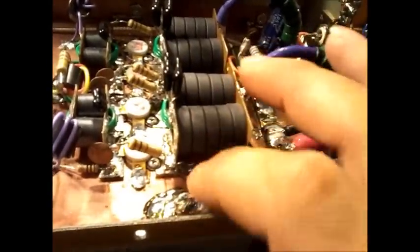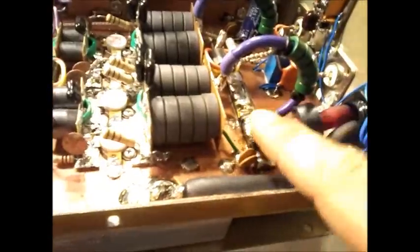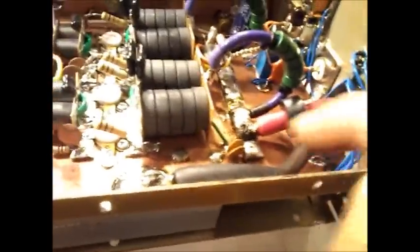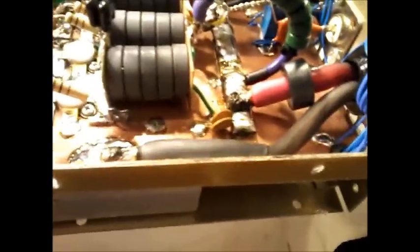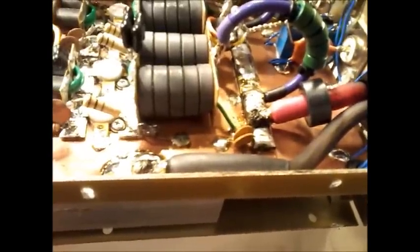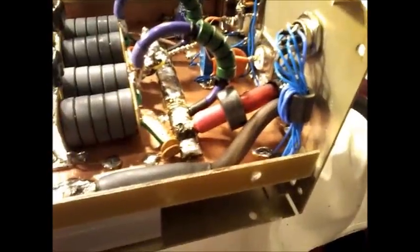It's just basically a little bit of extra work to get this wire completely soldered to this board and to this hot bus properly. Okay, it just needs a little bit of extra help since this is aluminum clad and it just does not take solder well, so you have to reinforce the connection. Because there's no way I could let this box leave just sitting like this. But I should have noticed that from the get-go.